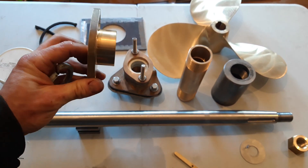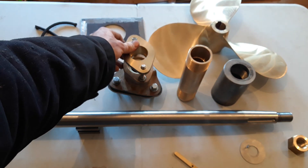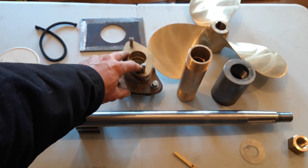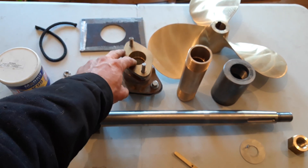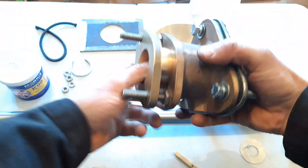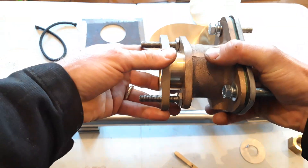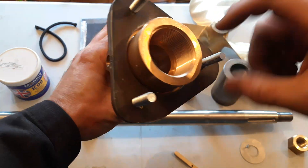When you put each ring in, make sure each cut is offset from the others — don't align all the cuts together. Offset them at different points around the clock face — one there, one there, one there — to stop water coming past and creating a problem. Clements have allowed for five rings in this gland. I personally would take one out to allow the flange face to seat into the ring and create a better seal. The only time you touch this gland is when grease starts coming out at the sides.